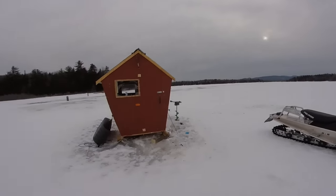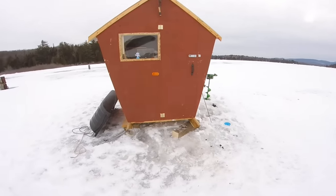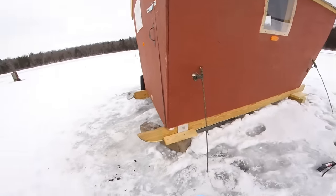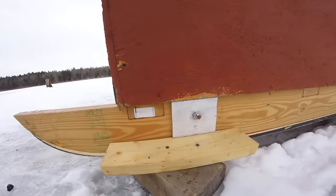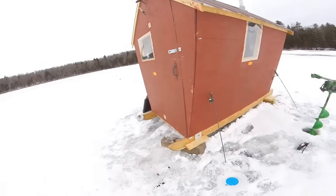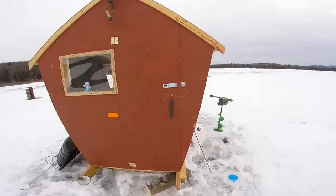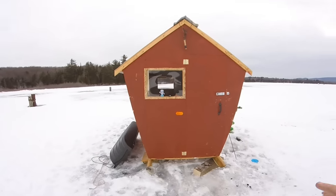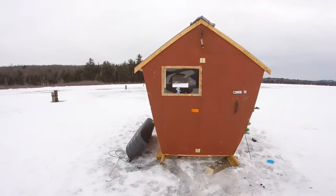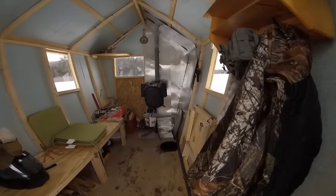I'm going to do a little review on the ice shanty today. It's kind of a unique shape and we did that because you have more shoulder room. The base is four by eight — just one sheet of plywood resting on top of supports, two by fours notched into two by six skis on the bottom. The walls at the widest point are about five feet high from the floor inside, and shoulder height is six foot wide — we added one foot on each side so it doesn't just come straight up four by eight. That shape gives us more shoulder room.